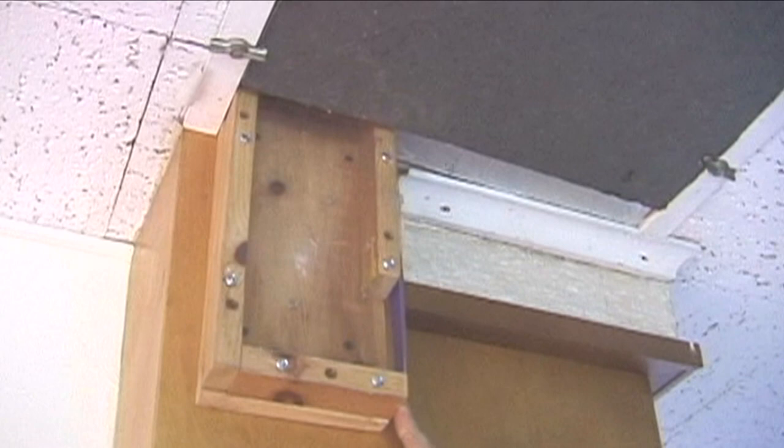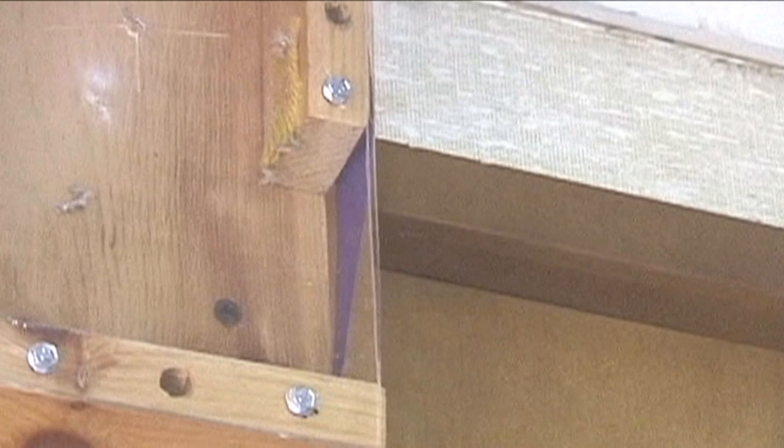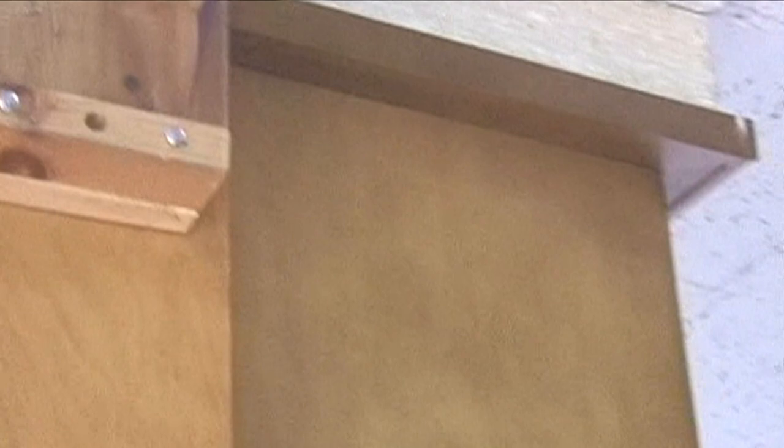And now he's going to close the stove door. He just closed the stove door. And we shut off the vacuum. Yeah, look at that. And now he shuts off the kitchen fan. Oh, he's got it on low. He missed it. But you can see the kitchen fan is still on low, Dick. All right. We go back to a positive pressure on the house. And the difference here is now the wood stove or the heating appliance would draw properly.